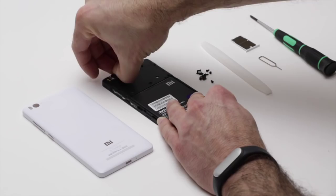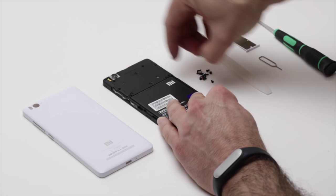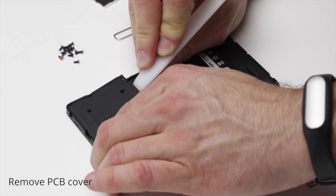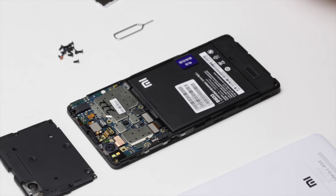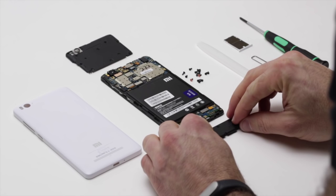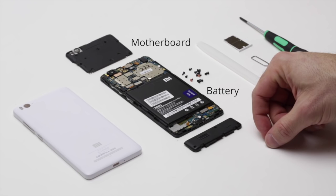I'm going to take these screws out one by one. Now all the screws are out. I'm going to first take out the cover for the primary PCB — the primary motherboard — and also take out the cover for the secondary PCB on the bottom of the device, where the USB port and the speaker are located. Here you can see the motherboard and how incredibly compact it is. We're using fast attach connectors as a way to make everything better organized, which also makes it easier to service the motherboard.